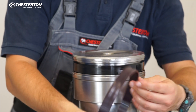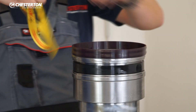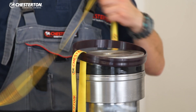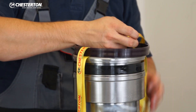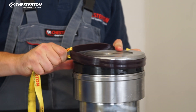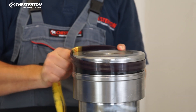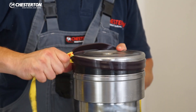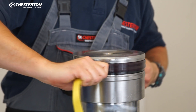Lubricate the upper cap component, then put the straps inside the dynamic part of the seal. Stretch the seal around the piston the same way as with the rubber energizer. Be careful — this seal is much more robust and it could be more difficult; use more force and ask for support if a second person is needed.